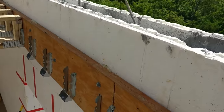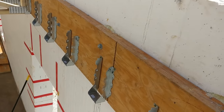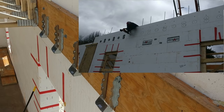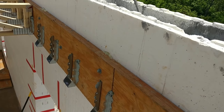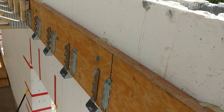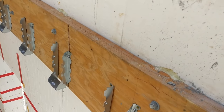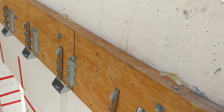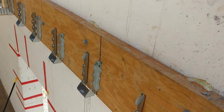You can edit in what it looks like on the outside so that they can see how we cut holes in the ICF and then anchor the anchor bolts. We put the LVLs in so it helps to keep the wall straight and then gives a permanent place to attach the joist hangers and then to put the joists into.